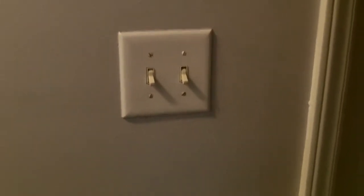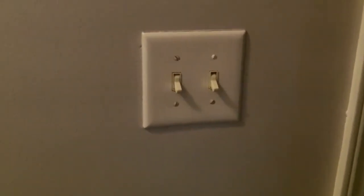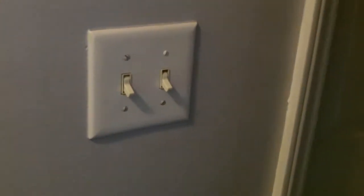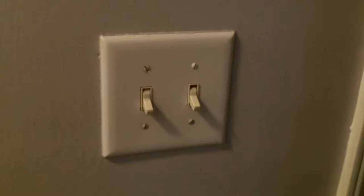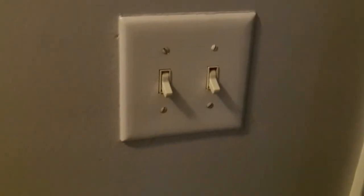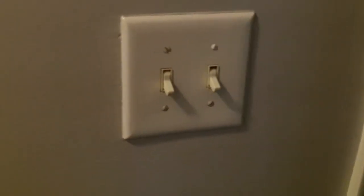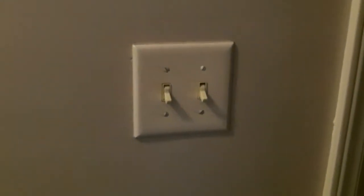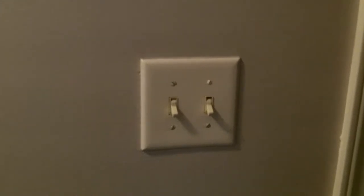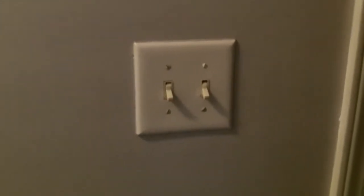Here's the outlet where I'm going to be putting in my new switch for the fan. I'm going to use a three-way switch so that I can have it up for just override and down for normal thermostat use. I know people online like to have two switches with a master and an override, but I didn't want to do that because I figured, what's the point of turning it off? Probably not going to want that.